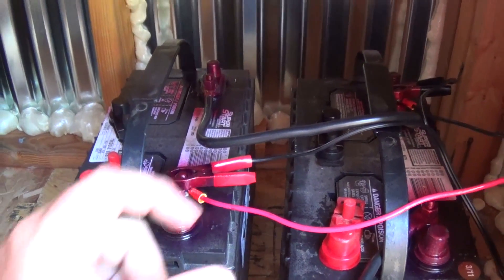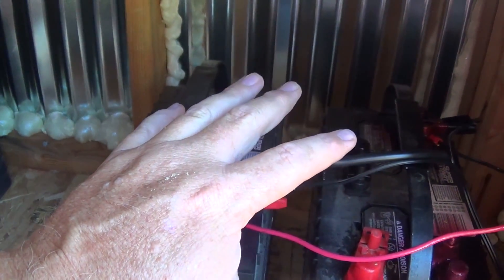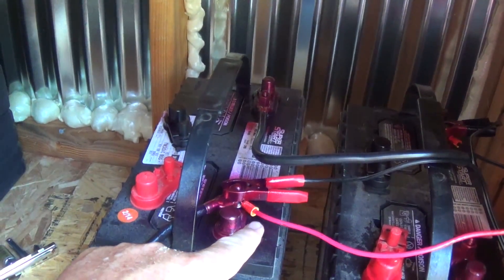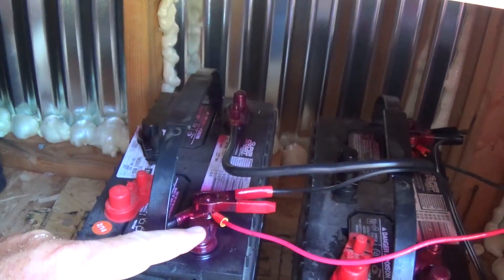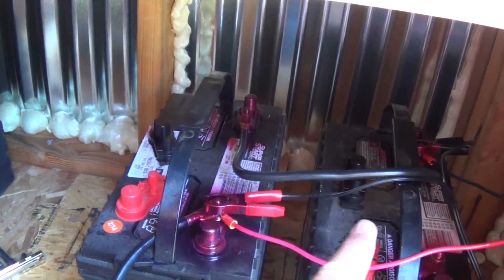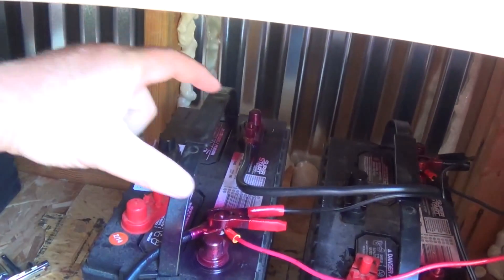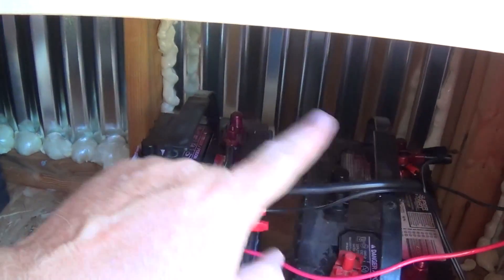Now how do I do the load? If I look at this as one battery, it's all connected. I'm calling this my positive and that one my negative - it's all one battery, and on a battery you only have one of each. So I'm going to hook up my load - this small wire here - and over there is my load going to an inverter. The same leads you hook up your charge controller to are the same leads you hook up your load to. This way you're charging the batteries evenly, treating the whole thing as one. If I put the charge controller on just one, it would always charge that one first and then filter to the other, giving you uneven charging. This way it charges the whole thing as one battery.